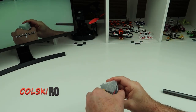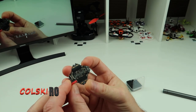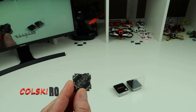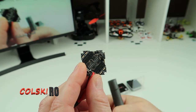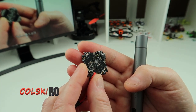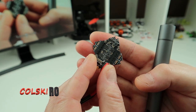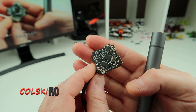Let's have a look at this first. The big thing about this board is it is a 4S board. Unlike most of these boards which are 2S and 3S, this one is actually 4S capable. It also has the MPU6000 gyro, a pad for a buzzer — which is unusual on one of these — and it's got non-inverted SBUS. I'm actually going to do a build with this on 3S, building a toothpick and hopefully getting it under 65g with this and the Diamond VTX.